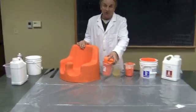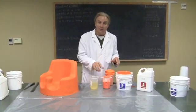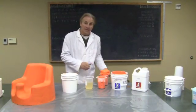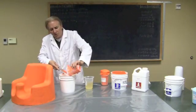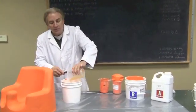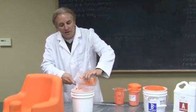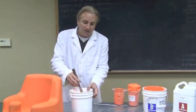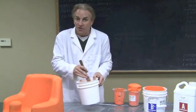So we're going to show you how to mix this up. This particular material is one to one by volume, and we've measured out equal parts of part A and part B. We're going to mix those in a clean bucket with a flat spatula. You need to be fairly close on your ratios. If it says by weight, do it by weight. If it says by volume, do it by volume, and you'd like to be plus or minus about 5% on that. If you mix too much A, you're going to get a foam that ends up being a little harder than target. Too much B, you're going to get a foam that may be a little softer and stickier than target. For small volumes, spatulas are fine, but for larger volumes you'd like to use an electric drill and a jiffy mixer.